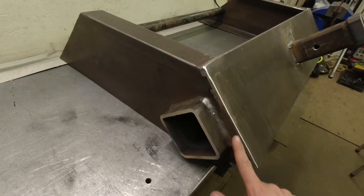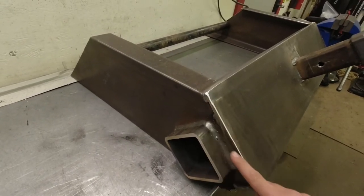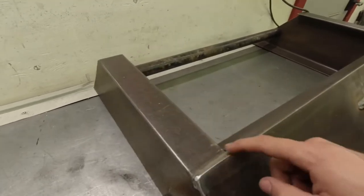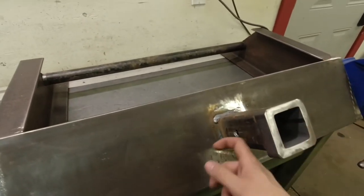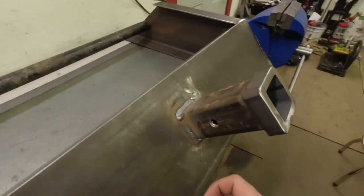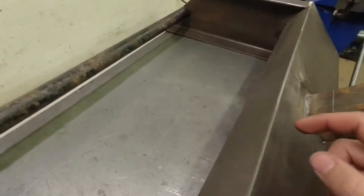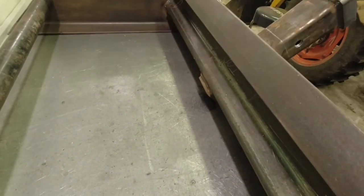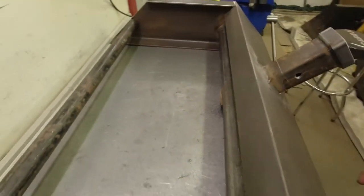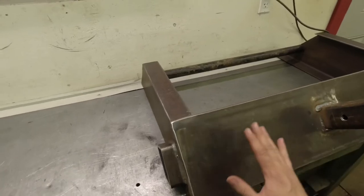We're gonna have to weld this seam here. You see me just cut that off. We're gonna weld this seam up. That'll be solid. We've already welded the tops. We got the actual 2x2 piece of square tubing. It's welded in all the way around on this piece of C channel, and then backside and front side of this piece of square tubing in between. This piece of C channel here is solely just for a nice flat face on it.